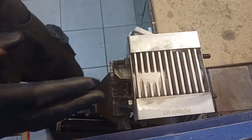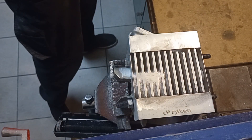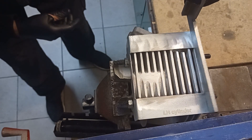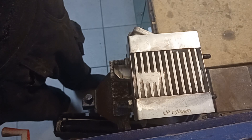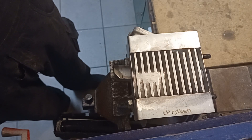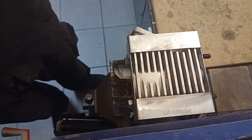The first cylinder is now done. I checked the clearance to see if it's really all clear throughout. Again, my strong recommendation — and I will repeat it one more time — wear gloves, wear protection for your eyes and ears, and especially use breathing protection because it really produces a lot of dust. I was glad I could vacuum it away, but for the next barrel I will protect myself even more.